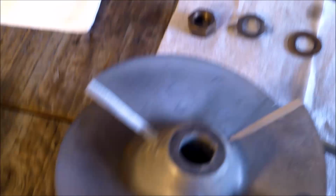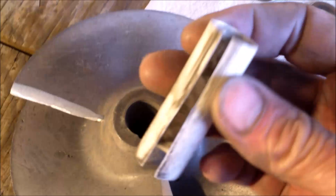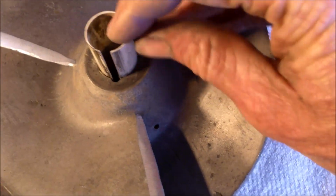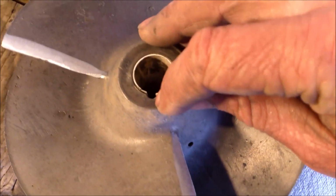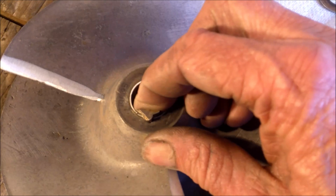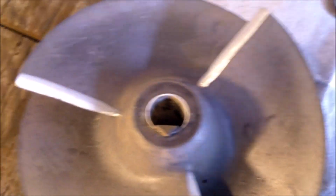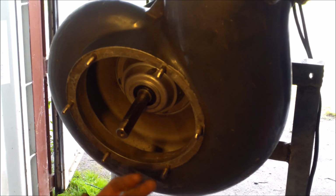First, I take my impeller. I have my small groove here. I take my liner and put that inside, aligning the opening with the notch, and the keyway will go here. Of course, sometimes it does not stay, sometimes it stays. That one stays, miracle. So I'm going to stack everything on my fingers: my shaft nut, my lock washer, my cup with the plastic rubber, and the shims here.